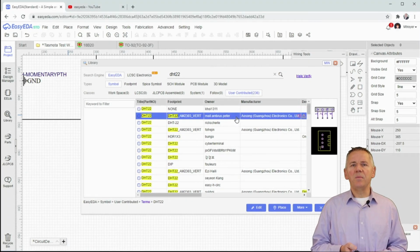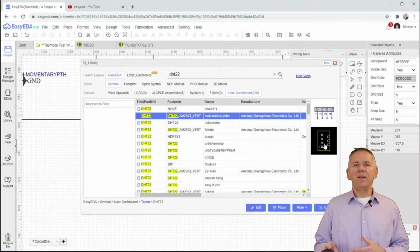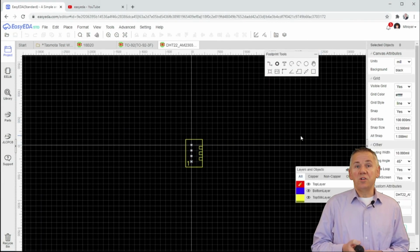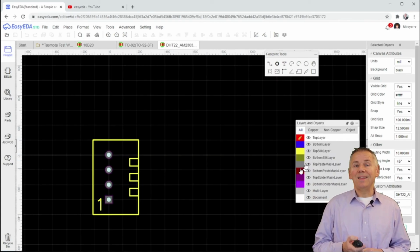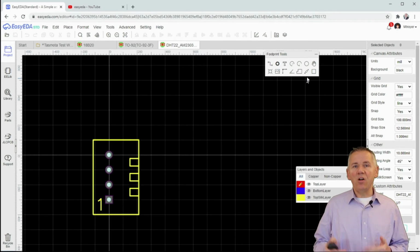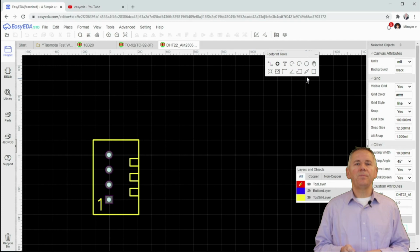It looks better, but let's verify the physical hole spacing. For the DHT11 and the DHT22, you should note that again there are 4 pins, only 3 of which are used. I'd like to find a component that has all 4 pins being used simply for stability purposes. Let's look at the PCB layout for this component.